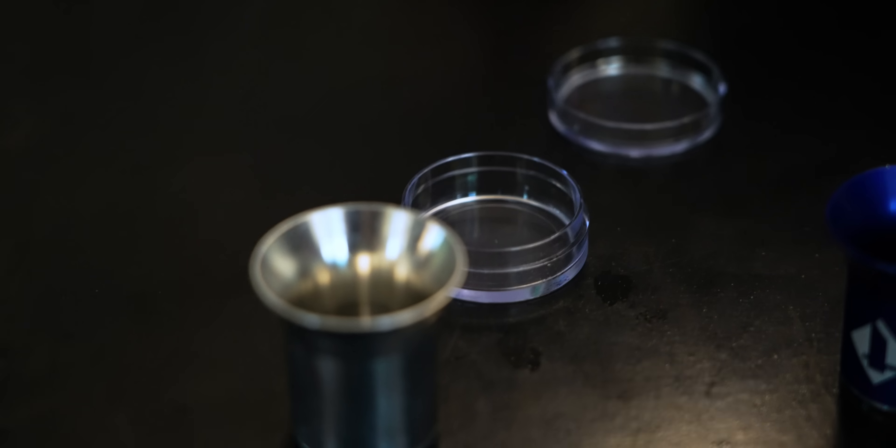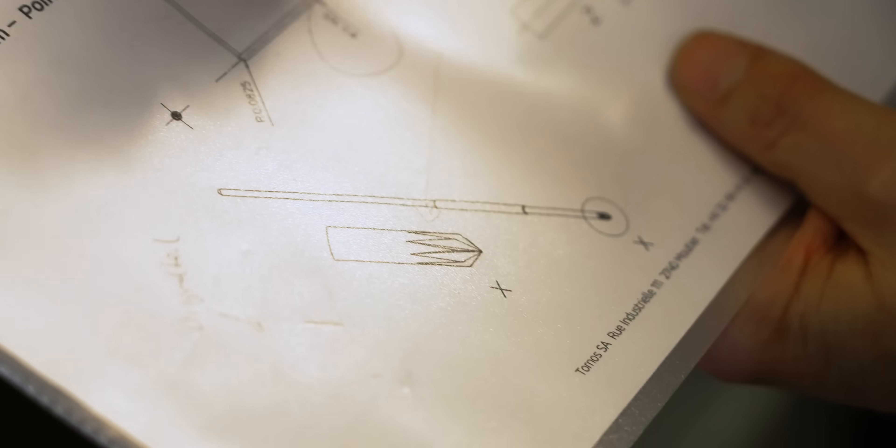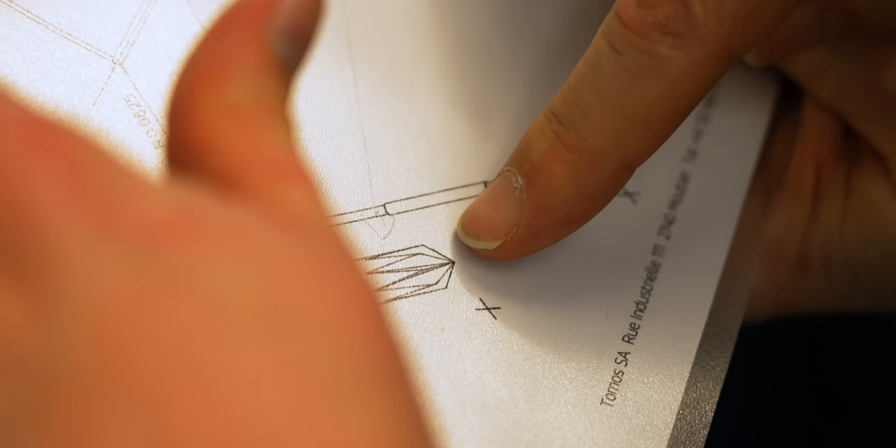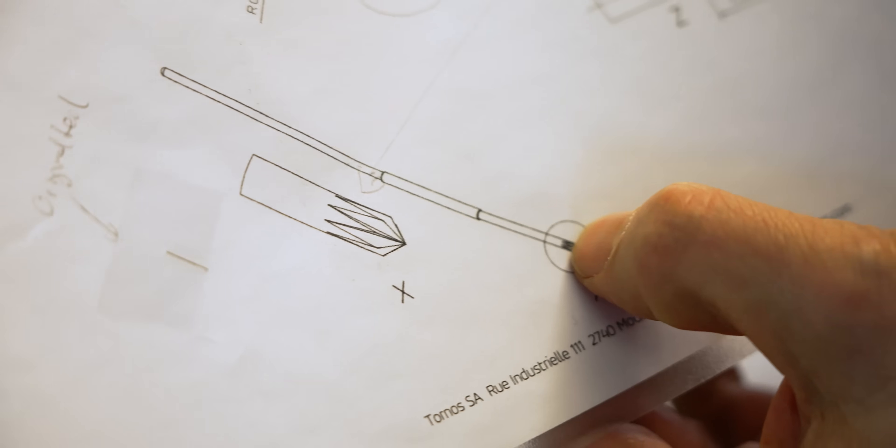And I'll show you the limits of the machine. I can even show it to the competition because I think nobody's able to do it. The diameter is 0.165 — that's about eight thousandths. So that's already thin, that's the material. The challenge is to put that on the top of it. This ran through a guide bushing? Yes. That's the original part here, but you cannot see it — it looks like a deburring tool almost. So this is the limit of things that can be machined. I would challenge any other company to try to match that.